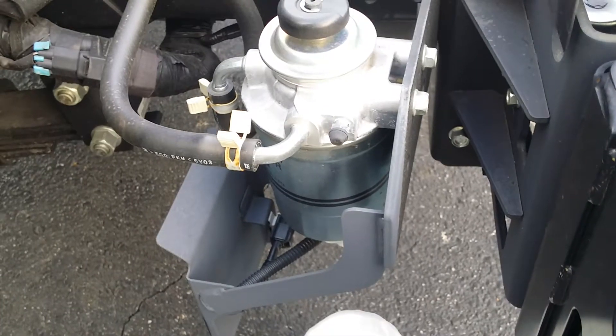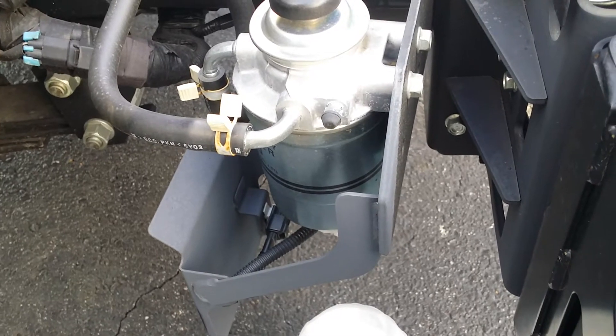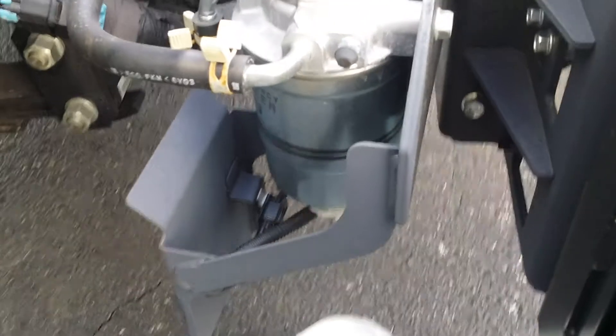If you're changing your fueling station, or if it's in the wintertime where we have a lot of days below freezing and rising above freezing, you'll want to go ahead and check to see if condensation has happened and you have water in your filter system.